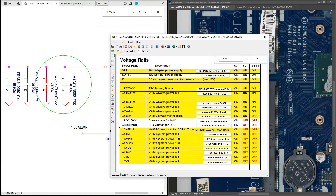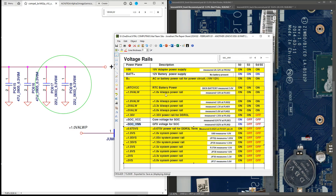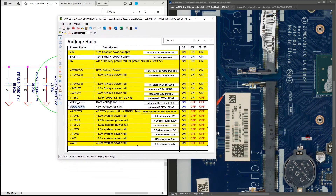This is the full list of voltages from the schematic. Anything marked in yellow is good. There's no battery with this unit, so I couldn't measure battery voltage, but that shouldn't be an issue - everything should work on just the power adapter. The only ambiguous readings were the two inductors from earlier where no target value was specified: I measured 0.917V at PL903 and 0.82V at PL902. Every other power rail was perfect.